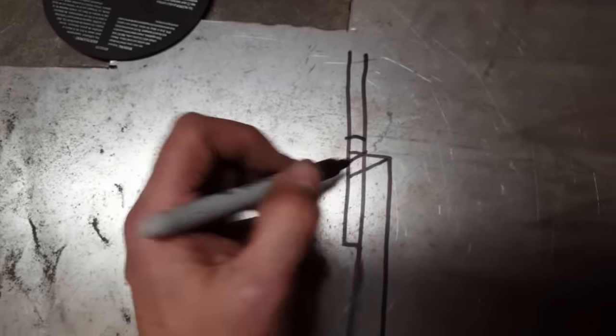Now I'll show you what's going on there. Now that I've cut it across, if you look down, you will see that this has fallen in. Because this one here, where I pushed in on it, wants to push in on this lower panel now. So as you're cutting it across, it'll want to pull in and relieve the pressure and make it flush going across. And you come across here and it's sticking out again still.